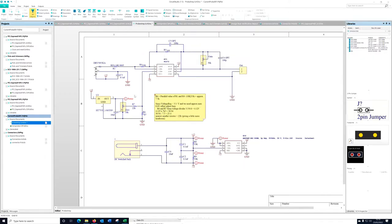You may recall from the first video that I was a bit concerned about the thermal stability, certainly around the zeroing circuit which is over here on the left-hand side of the diagram. This was really sensitive - if you just touch the trimmer it would drift quite a lot thermally. I was going to just send it off and see if it was better on the made board with no long leads and capacitance, but I decided to go back and give it a bit more thought.